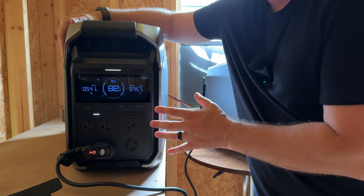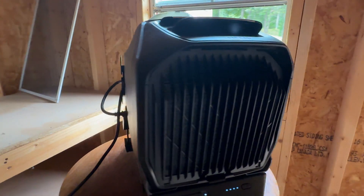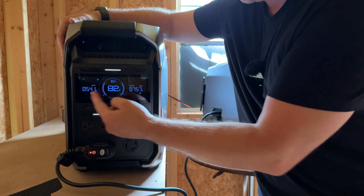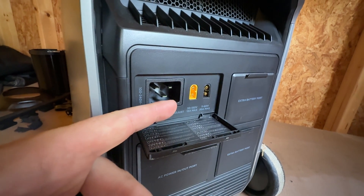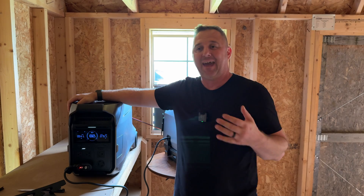From the EcoFlow Wave 3, I'm pulling about 760 watts — just under 760 watts — and that is a lot of power. So I'm definitely going to run out of power eventually; I'm pulling more power than I'm putting in. But even adding one or two more of those 500 watt configurations could possibly allow this system to run as it's configured right now.